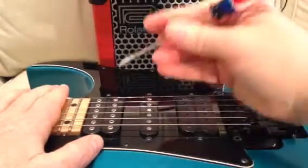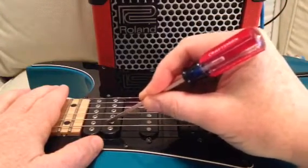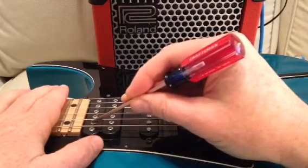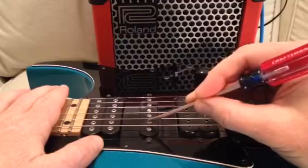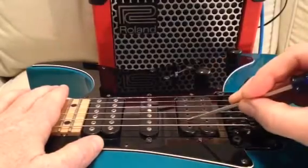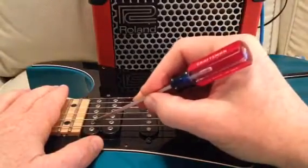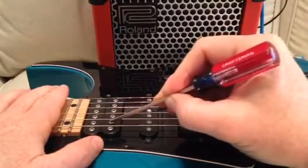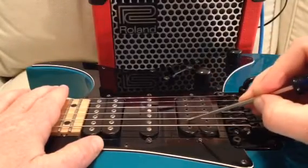Switch to the next position and I'm running the inner coil on this humbucker but not the neck coil, and the middle position is running with it. This pickup is off, and then if I pick the neck position I'll find that the neck humbucker is completely on and the middle is now off and the bridge is now off.